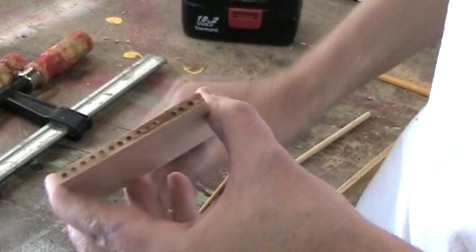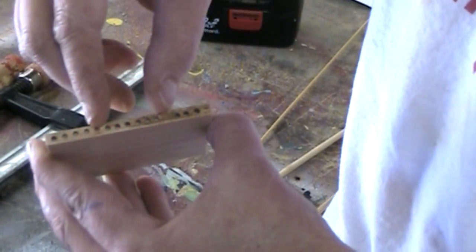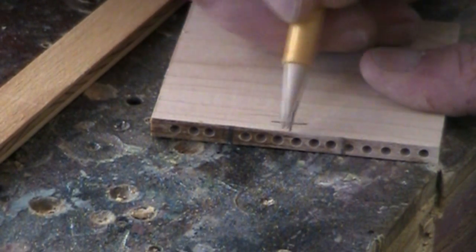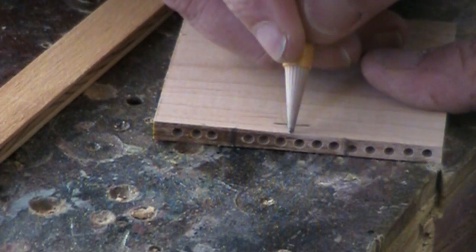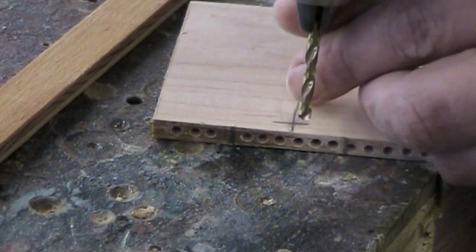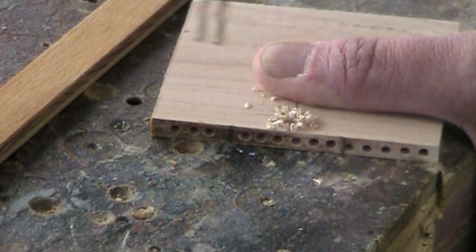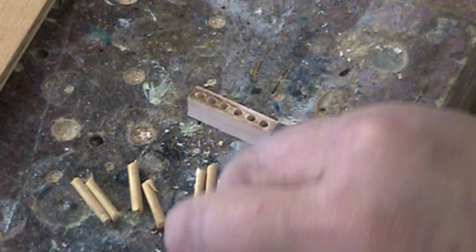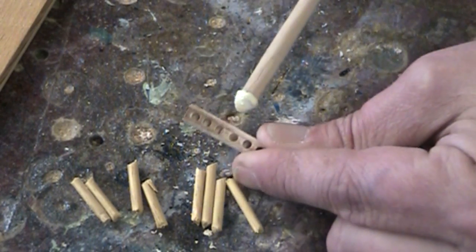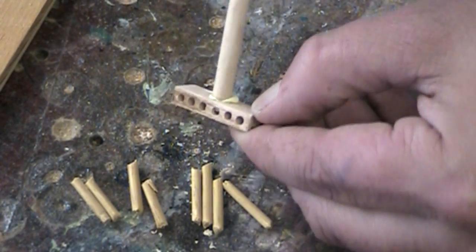I've taken a piece of quarter-inch maple and just drilled a whole bunch of holes in there. They're really not that accurate, but hopefully somewhere in there I've got some that are pretty much straight. I can stick in these dowels and that's going to create the rake. These six holes turned out pretty well — they're pretty straight. I've made a mark here and here, and in the middle is where I want to put the handle of the rake. I've eyeballed it and put a little X there. I'm going to drill a hole in there with my hand drill, just going a little ways in. I cut out a whole bunch of itty-bitty dowels that are going to be the tines, and now I need to stick the handle into the rake. I've cut this all down to size, so now I'll just glue it all together.